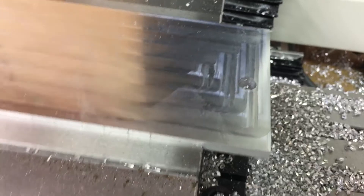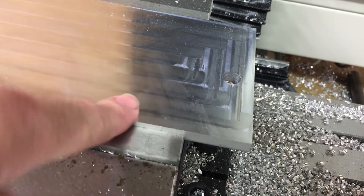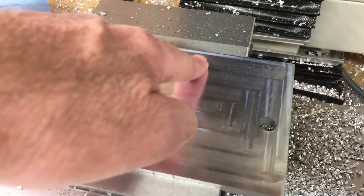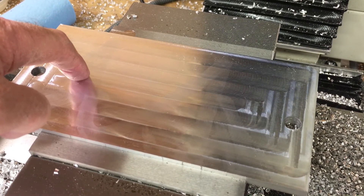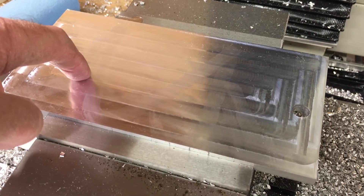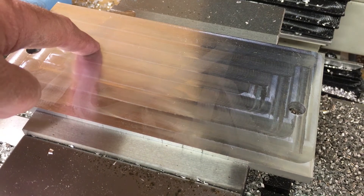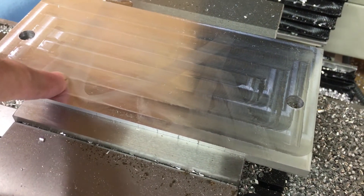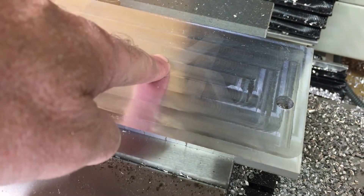That made quick work of facing at 90 thou. I'd probably go even more, but it looks like I've run out of stock, and I don't want to run into the jaw. The surface finish is about the same as the last — maybe a little worse; you can feel the ridges a little more in some spots. Out here it's actually not too bad. It's mainly in certain areas. On this side it's really smooth, but in the back for some reason it's not — not sure why.